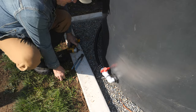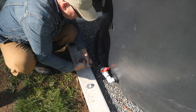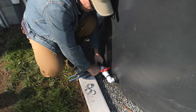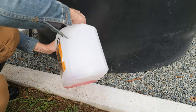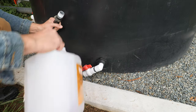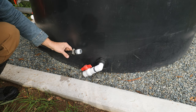When the 1,200 gallon tank is drained, I'll disconnect the pipe from the valve for the float and screen. I used pinch clamps when I plumbed this, but I realized I should have used screw clamps or even some type of quick disconnect. The line on the left runs under the concrete curb on its way to the pump inlet in the back of the shed. The low point is where the pipe drops below the curb — I decided to pour some antifreeze down the pipe and flush it out in the spring.